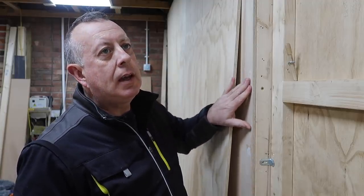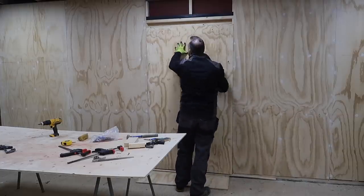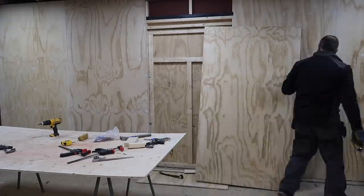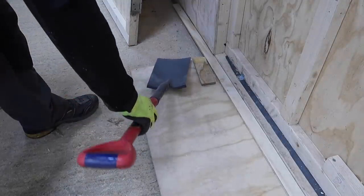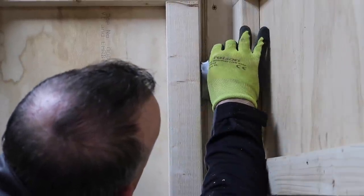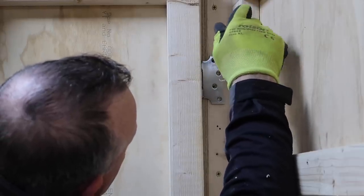So once that door is on I'll sand this down and I should be ready for a coat of paint. The centre internal door I built in a similar way to the external one by fitting the frame in place first — already wedged into position — then offering up the ply to it and after fixing together with a couple of temporary screws it can be taken out and joined properly. I used my router to very quickly take out material to the correct depth for the hinges. Here's a tip: if you don't have a nail bar you can always use a spade to help lift the door while fixing. Without using some kind of lever this type of job is really difficult. Although I don't really like wearing tool belts, when you're working on your own they're invaluable as you've always got one hand holding the door and you really need your tools and screwdrivers within easy reach.